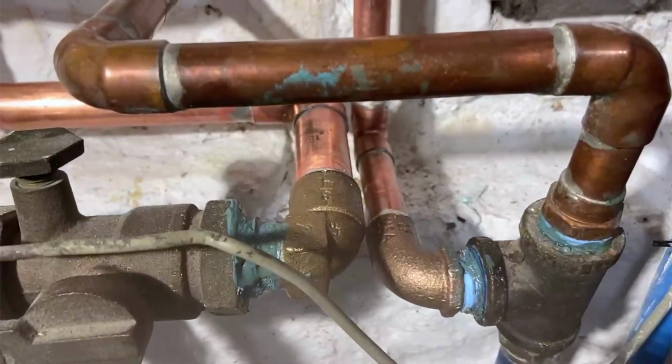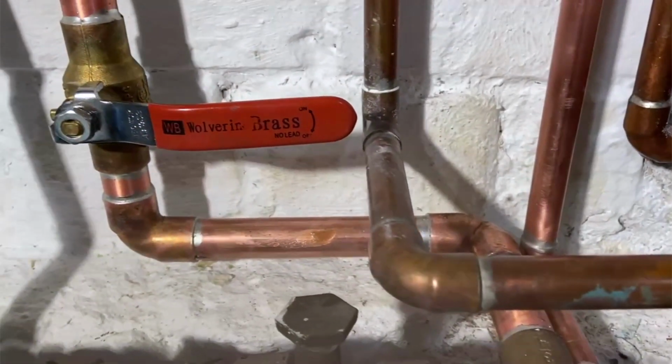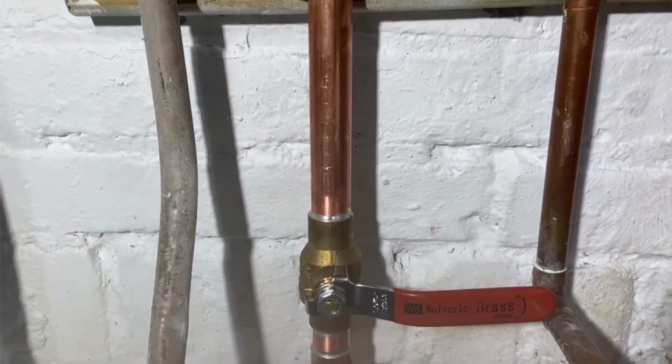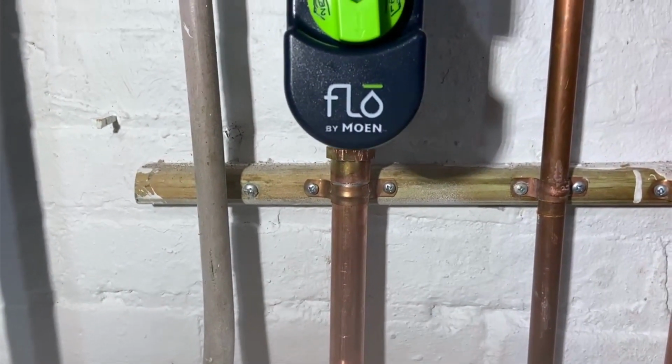So you can see I had barely enough room to get those 2 elbows in there. And I swung it over. I put that valve in this way. I told him you don't have to mess with the meter set, because he said when he touched those ball valves on the meter, sometimes they leak. So he can now shut that ball valve off, and he can shut the whole house off.